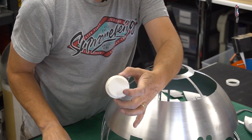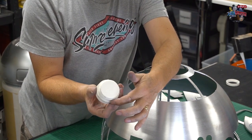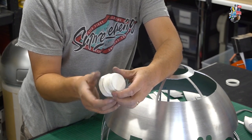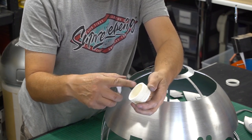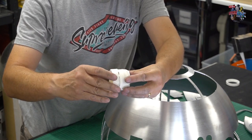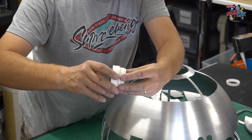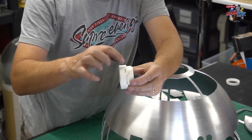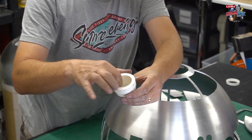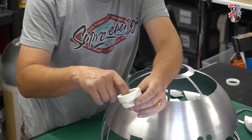That's the front, obviously, and it's got a thread on it. So this sits in the hole that you cut for the rear PSI. Then you get a threaded piece, and your board sits on the back there, and this goes over the top and holds the board in place once you do the thread up nice and tight, like so. There's a bit of distance from the front and back to give you some diffusion, and you can always put extra plastic in there to diffuse it somewhat, like a milk bottle carton or something like that.